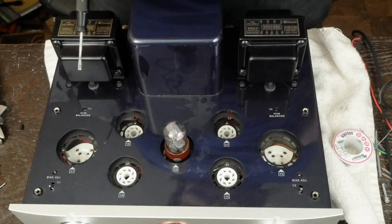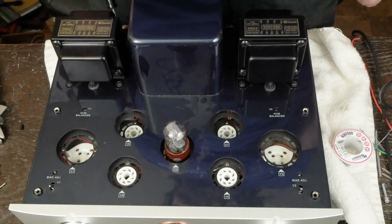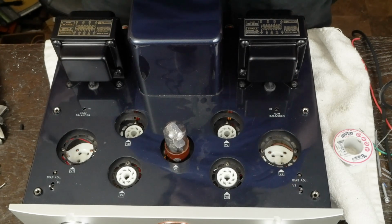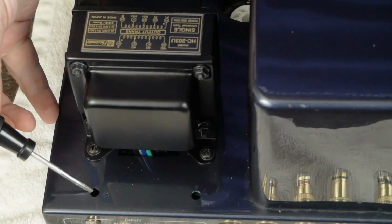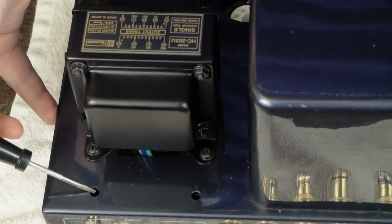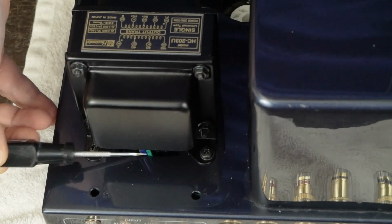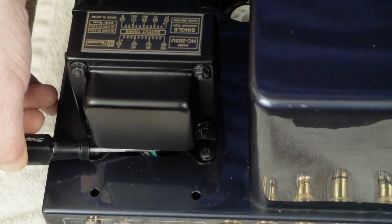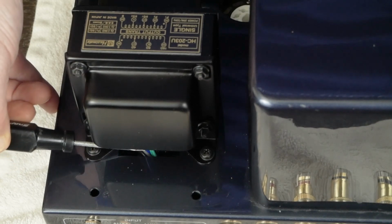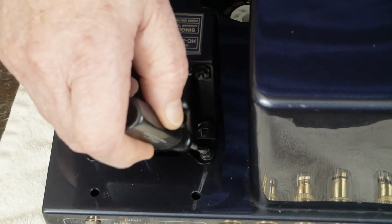But again, on this side you need to be really attentive to these rear holes and the stuff on the inside that could interfere with attaching the rear of this transformer. From the back side, it's going to leave a couple of holes here, which, if it's sitting on a shelf, you're not going to see because they're behind the transformer. Then we run the wires for the secondary side of the output transformer through the big square hole that the original transformer turret went through, and then just drill two new holes here.